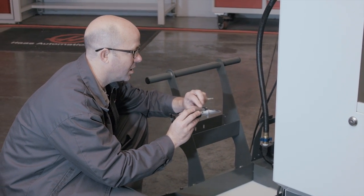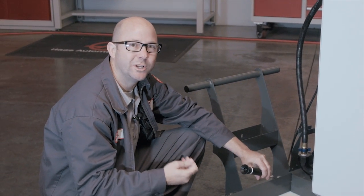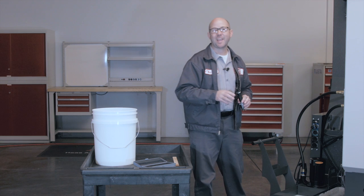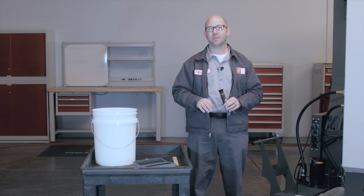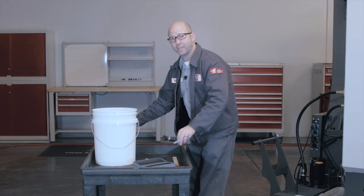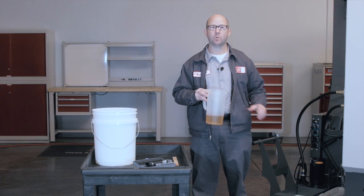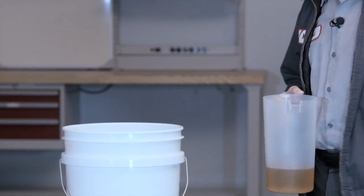In our case, our coolant concentration is at 8%. Coolant tends to become richer as water evaporates from our solution during use. Since 8% is on the rich side, we're going to mix up some buckets of lean coolant to add to our tank. We know that adding one quart of concentrate to our five gallon buckets gives us a mixture of 5%, so we'll only add half a quart of concentrate to our top-off buckets to give us that lean mixture to cut the rich coolant in the tank. We'll add those lean buckets until the tank is full. Remember, when topping off your tank it's best to use deionized water so the hard minerals in your tap water don't build up in your tank. The minerals left behind tend to accumulate as water evaporates.